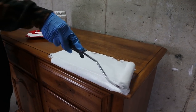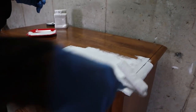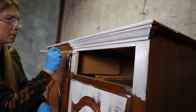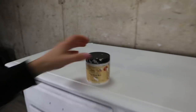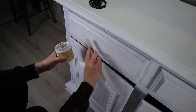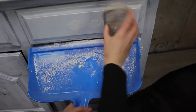I like to use a roller as much as I can for this to avoid making too much texture. You do need to use a brush for some areas, like the little areas that are hard to reach with a roller. We will need to cover those holes with Dixie Mud as well. Once it's dry you can sand it smooth — I usually leave Dixie Mud dry overnight.